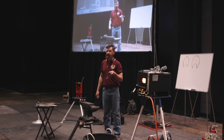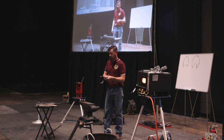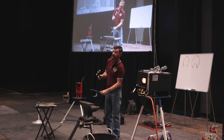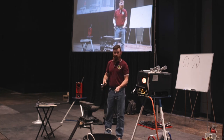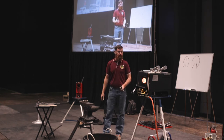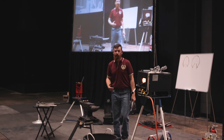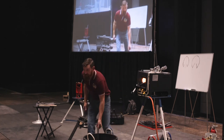It sounds really rudimentary basic, but it's really difficult to make ourselves want to do the hard thing versus the easy thing. Okay? And that's where a lot of this forging aspect comes into play. And on this side of the shoe, it's really difficult because, again, we're going against our natural body a little bit. We're trying to get in our own way. We're not able to come here and just have a nice swing to it, right? So now we've got two things compounding that make it more difficult. But you just kind of got to go through and embrace the suck. You know, and just force yourself to do it that way. Because you get a lot better in the process. But it also shows that you have an understanding of what your body's doing and how the material is moving, and you're making it go there for a purpose. Okay? We don't have to try to get it flat if we didn't make it unflat to start.